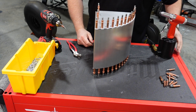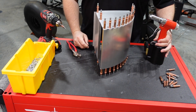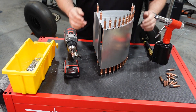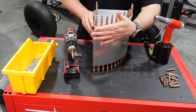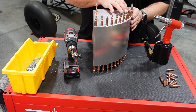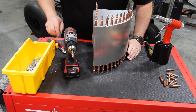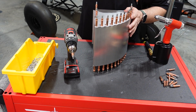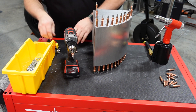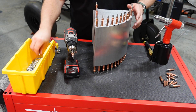Alright guys, we're back at it. We've got everything Clicoed together and we've added a couple more tools — the riveter and a drill to clean out any holes. Because the larger aluminum piece is on a bend, it puts a little friction on the holes and sometimes they don't line up perfectly, so you just have to clean them up real quick. We're going to do the standard remove-a-Clico, every other Clico, and start dropping some rivets in. If they drop in, great; if not, we'll clean them up with the drill bit.